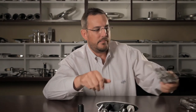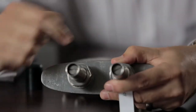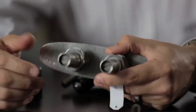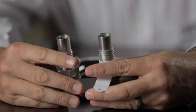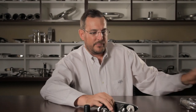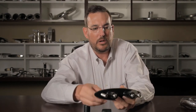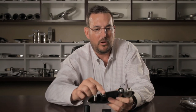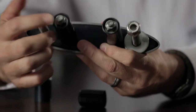One other quick feature I'd like to point out: on the competitor's cleat — and frankly our old cleats — you can see that's a male screw that goes up in to hold the leg. That was the way it was always done, but we found that sometimes over time the male screw would actually vibrate out. On this cleat we've got a solid bolt going from the top of the cleat, welded all the way through with a nylon lock nut. It'll never vibrate off — it's just a better product.